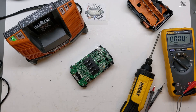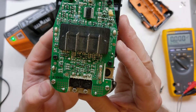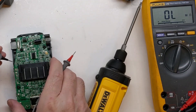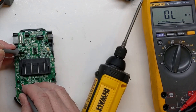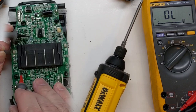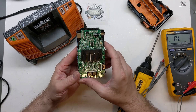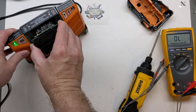I have had that help with some 40V packs, though I don't really deal with those much anymore — they're just too problematic. On this one though, I do see some corrosion, so I'm going to go spray some contact cleaner on there. Since it's under power, I'll use contact cleaner and clean it up. I don't believe that's causing the issue though, because the only trace going across there — there's a test point you can see — goes all the way down to R13. I don't think that's causing the issue, but I still want to clean it up.